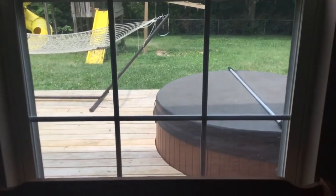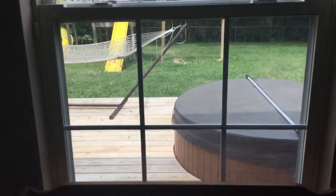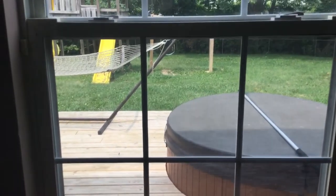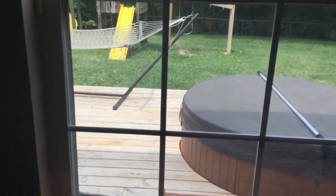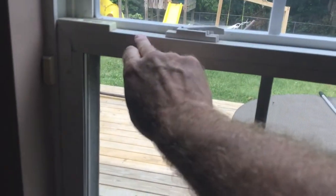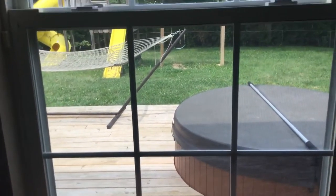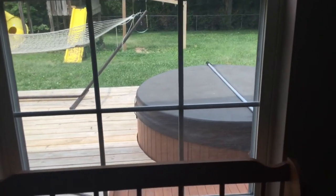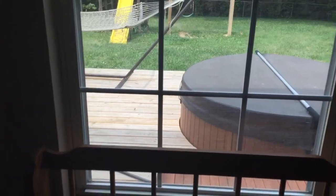In my case, mine was full of silicone — someone had gone crazy and siliconed it up. I had to yank it out and even sort of destroy the IGU itself — I broke the glass and tore up the metal framing just to rip it out of the window sash. The window sash is just a piece of vinyl and it will stay — that's going to be unchanged. All you're doing is replacing that little glass unit. I'll link you to videos where they show you how to pull them out without damaging the glass. There's nothing more to the job after that.